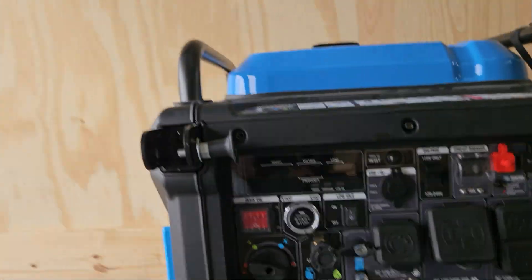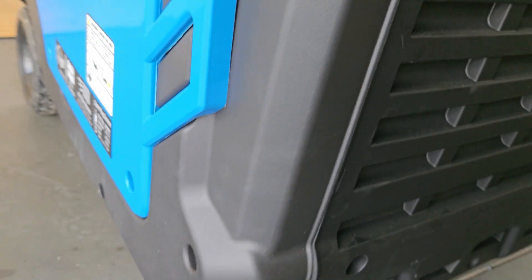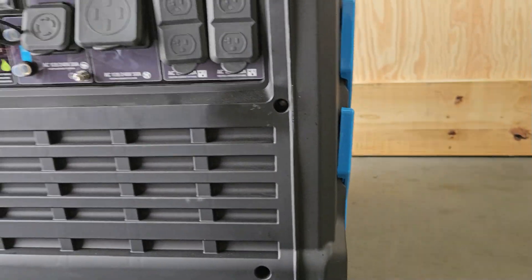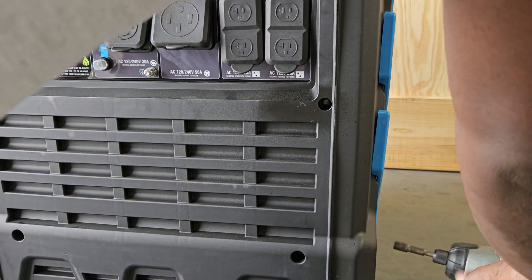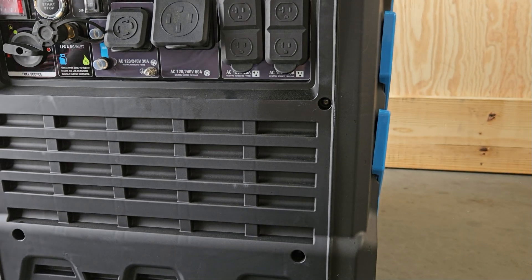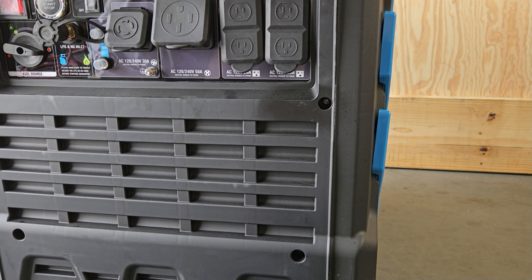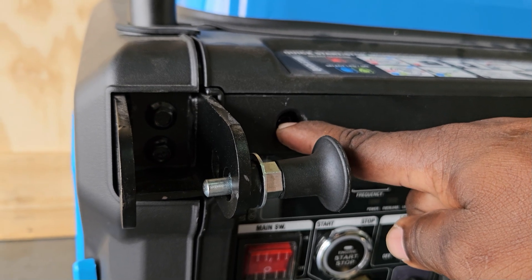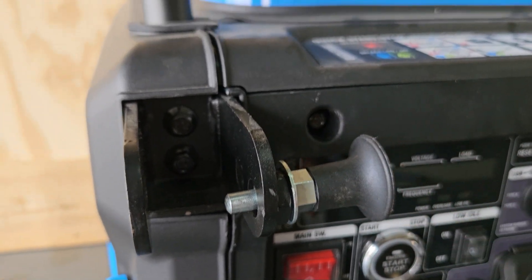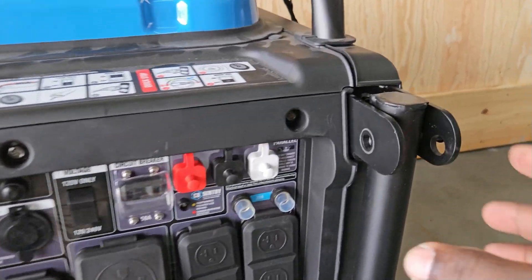Here's a little trick: if you can't get the cover to sit down, just loosen this screw right here and the one on the side, and it'll go back much easier. Just loosen them a little bit — don't take them all the way off — then press the cover back. Also, when replacing this panel, you may have to remove the display to get access to that screw; I have a long 5/16 so it's not a problem for me.